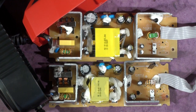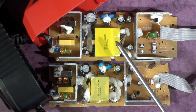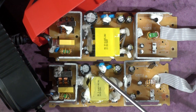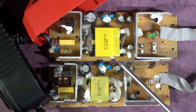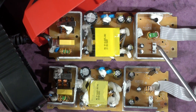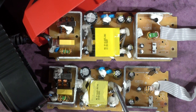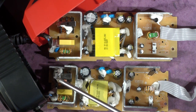Here are both battery chargers side by side with the backs off. Immediately obvious: the Lidl version has a much bigger transformer, because the power rating is much higher. It's only 20% more power but the transformer is proportionally much bigger. The reservoir capacitor is larger too; different manufacturers but different values. An extra capacitor here, same driver transistor, similar input filter but different layout.